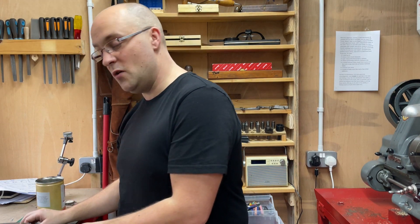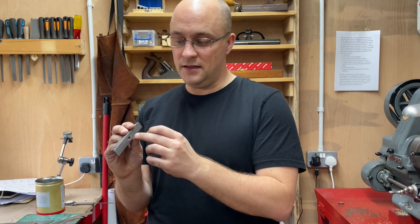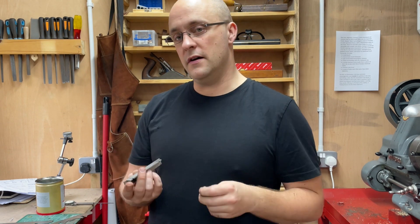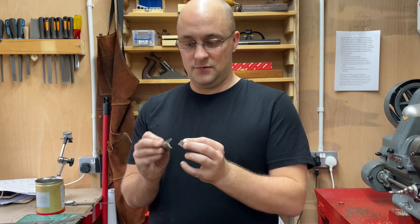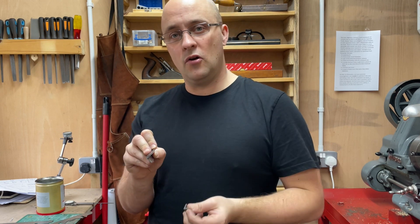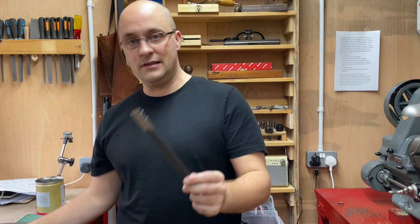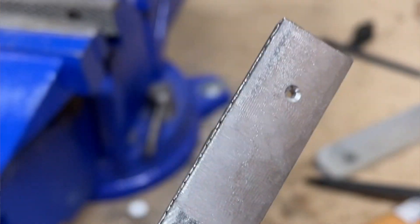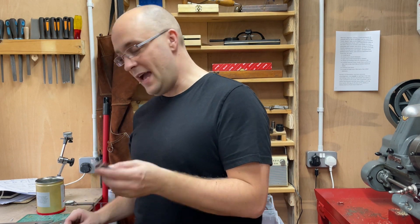There is still a question as to whether I'll be riveting or brazing the angle to the tender beams. On this front beam there's nothing else on here so it's kind of immaterial, as long as I get that nice and smooth. On the other beam there are holes to screw in buffers, which is a little more problematic — I've been practicing riveting and I've got an example here with some 1/16th inch steel rivets, and that seems to have gone quite well. So that still needs to be determined, but based on the outside dimensions of these two slots we know how wide the chassis is going to be.